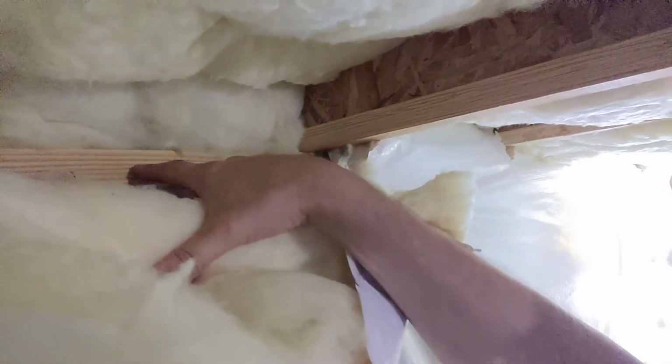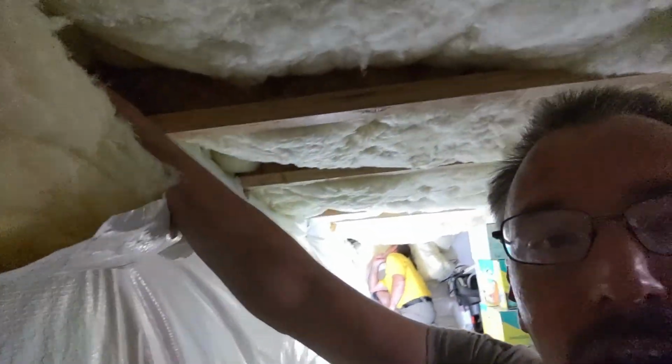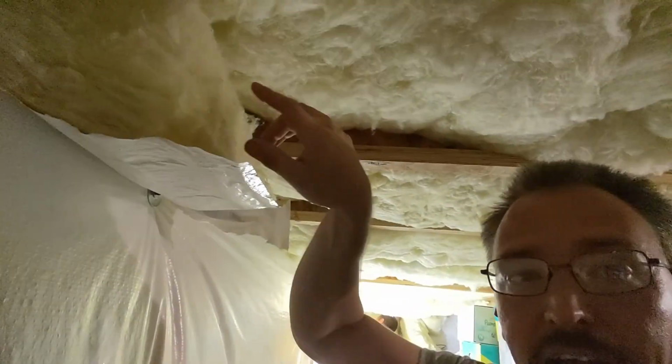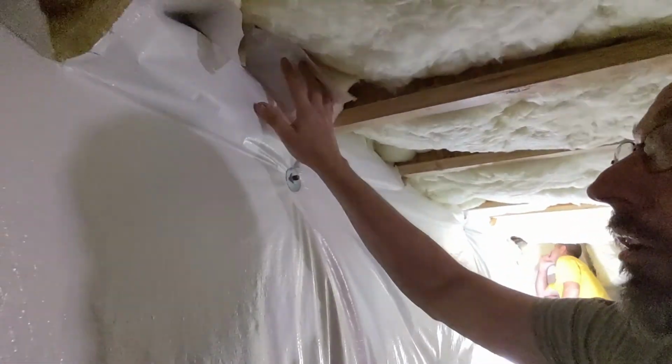That puts the middle of our deck board right in the middle of this sill plate, which is great. But then if you run screws in the top of that, there's nothing but OSB for it to attach to. What Norm's working on right now is cutting some lumber and getting that wedged in between these two joists, tagged in so they're secure, to give them something to tie that top of that ledge board into so that that's all secure and where it needs to be.